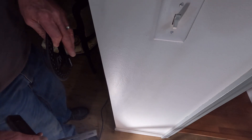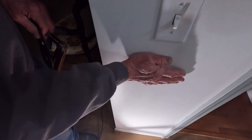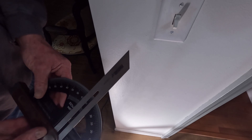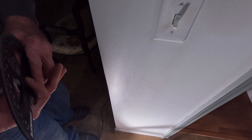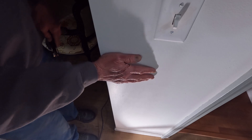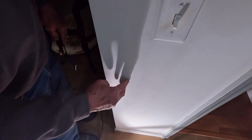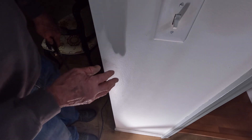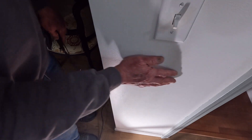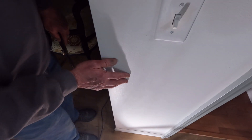So which one do we roll with? We roll with this being straight, because like I said, we don't want to push that trim in. These are things you have to check for before you throw this on here, throw it on the Sawset, cut your trim, and come in and wonder why it didn't work. Of course it didn't work because you got a bad reading off of that wall. The shorter walls are going to be the worst — they'll have the dips in them because there's more material in a smaller area. Longer walls everywhere where the drywall butts together and there's a finished joint, there's going to be a little hump in that wall — it could be over a foot or a foot and a half wide. You can't see it, you can't really feel it, but it's there.